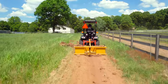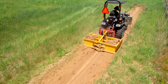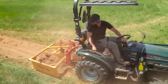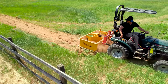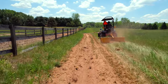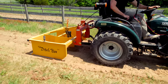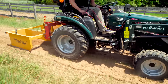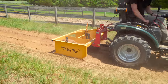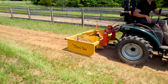We've talked about that before. I feel like it's my duty to point that out because it's insane how much I use it once you have it. When I didn't have it, you just kind of make do because you don't want to hop on and off the tractor to constantly make adjustments to lengthen or shorten the top link. But once you have it and you can make those adjustments on the fly, changing the angle of your tool is so easy to do and so handy to make corrections instead of stopping all your momentum and resetting everything.